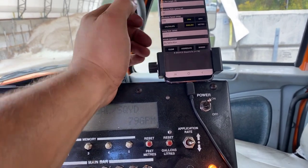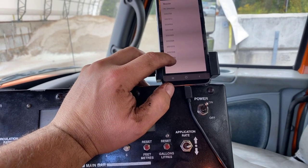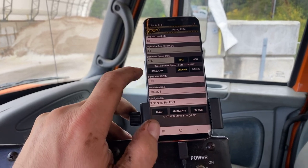186 is the top speed with the nozzles I'm using. I'm using 335 2205 nozzles and three nozzles per foot. I'm in the green.